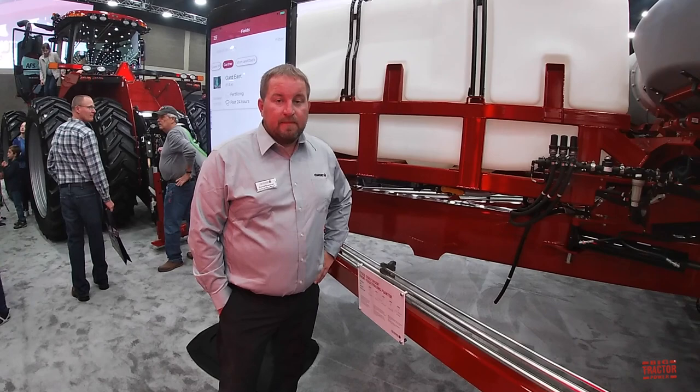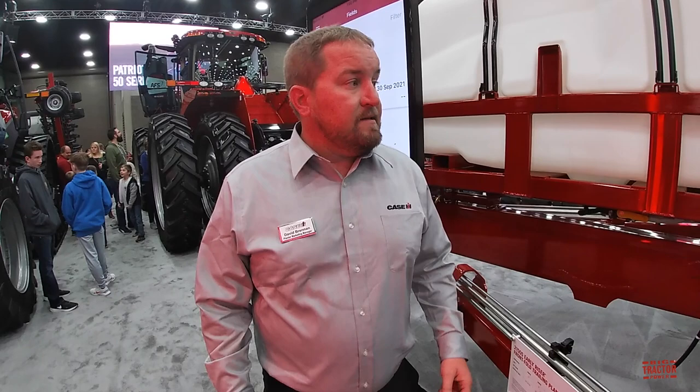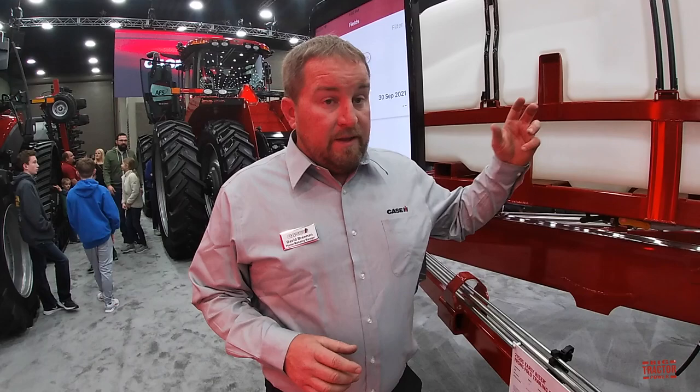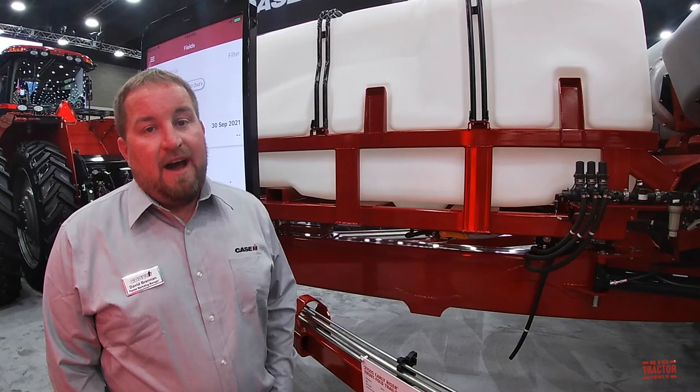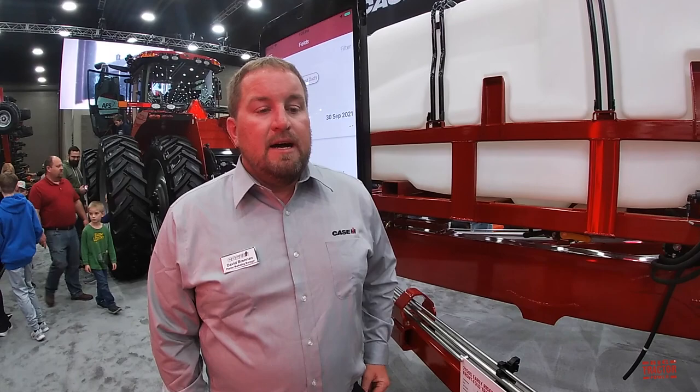What is the setup here as far as your fertilizer tank and your commodity tank for the seed? Yeah, so we absolutely understand that a grower, to get that crop into a narrow planting window, is going to gain some yield by getting into that optimized planting window for the geographic area that they're planting into. So we look at capacities, and so increasing those capacities with liquid and seed so that we match the fills on those and the operator can spend more time in the seat getting that seed in the ground. So we look at liquid capacity first, and it's an all new tank design for us, 525 gallon capacity out of that tank. So whether that customer's applying that product in furrow, whether he's doing a 2x2 solution, which we have several different solutions, frame mounted, row unit mounted, for those customers from the factory, we've got multiple different application points with this liquid fertilizer system.